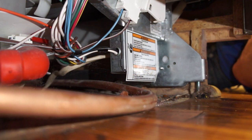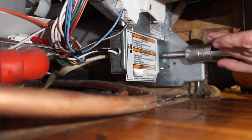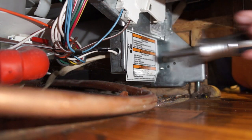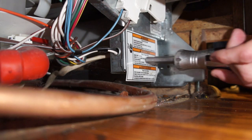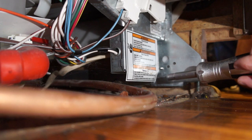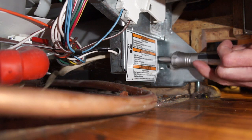The last line holding the dishwasher in is the electric line. Those are located on the right side of the dishwasher. At the bottom right corner, there will be a box that has all the warning labels on it. Remember, we've got our power turned off at the breaker box, and it's good to test the dishwasher first to make sure it doesn't come on so that the power's off before you go opening this up.